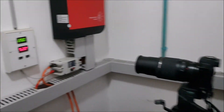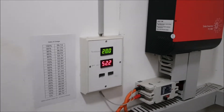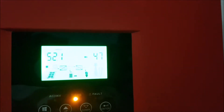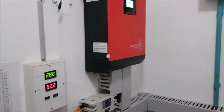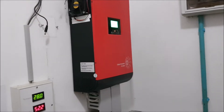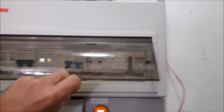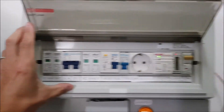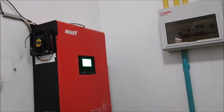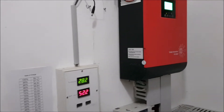The second camera will watch the voltage — this one, the red value. At the moment the battery is charged with 47 amps, which is perfect because our other system, the LFP, the chargers also have 45 amps. So it's almost the same conditions. We are going to shut down the DC from the solar array and then the chargers will stop charging the battery and we will watch what happens on the voltage.